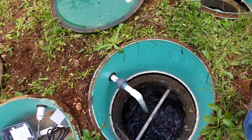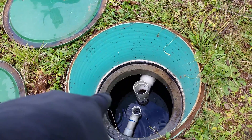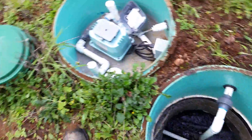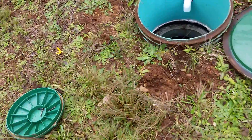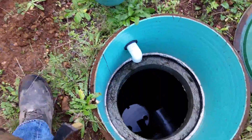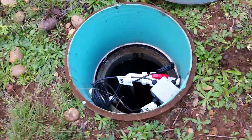As long as we don't allow more than 24 inches of sludge on the floor of that tank, this tank will stay relatively clean. Our discharge is into a pump tank, and it's pretty low because the pump is running everything.